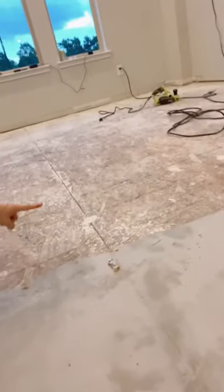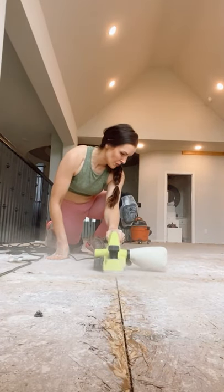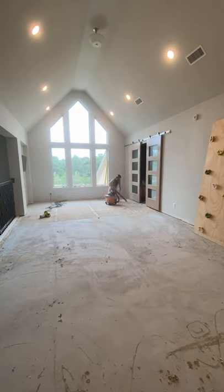What you need to do is get a concrete that you can smooth on, and then we can start laying floors. I had to scrape the floor where all this glue is because all the carpet pad was glued down — that was really intense and zero fun. Now I'm going to use my planer and go along this ridge right here because it's kind of bowed up. We'll take off a layer, flatten it a little bit, and then use the feather finish because it's way more than a quarter inch, so we have to take it down with the planer first.